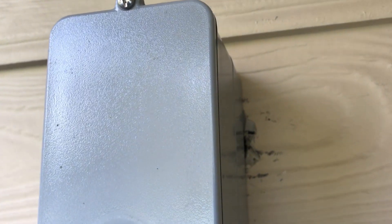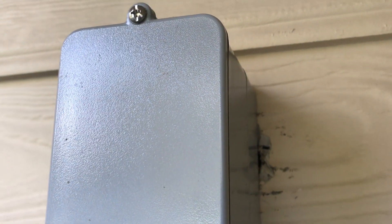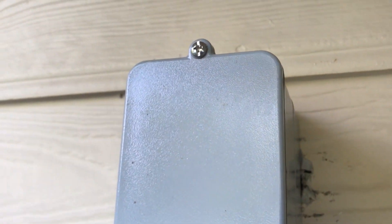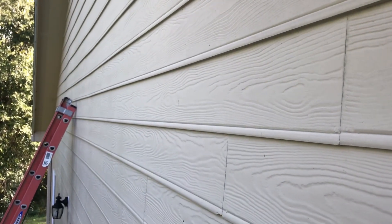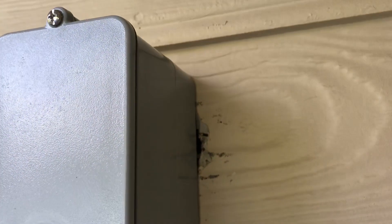The LB comes straight down into the top of the main panel, and that gets us into the attic. This was the first hard step. Now we'll start roughing in the rest of the conduit, take measurements off it to know what length wire we need, then go buy and pull wire. This is the part I'd been avoiding because I do have to kill the house power and do the tie-ins. Once all the house work is done, we'll replace the line out to the shop, which can be done anytime without disrupting the house.